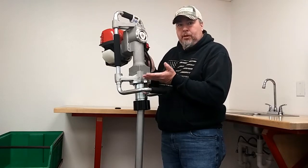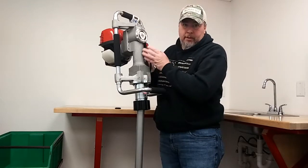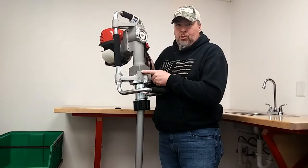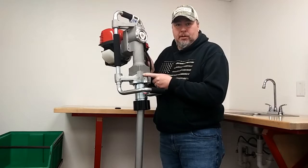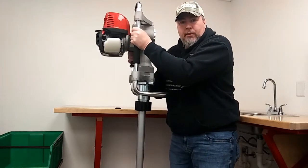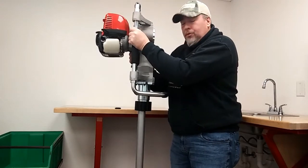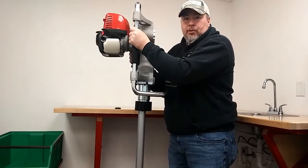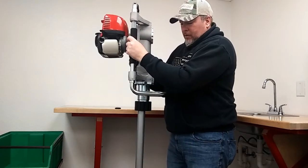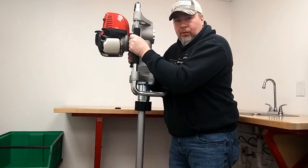There's not enough weight to push the anvil back up inside in order for the hammer to strike it, and again you'll damage the o-rings, lower body sleeve, and whatnot. So you need to make sure you have enough downward force on the driver using two hands when driving a post. You don't need to hang on it, but you just need to use a little downward force.